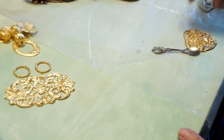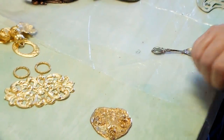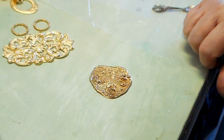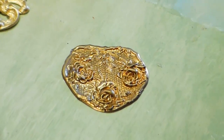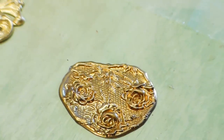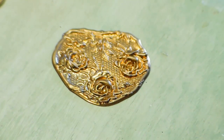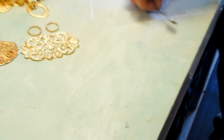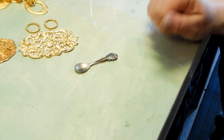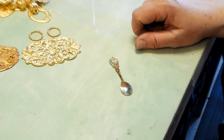This is a piece of raw brass that's been exposed to air for some time — it's got a little reddish patina coming on it. That's because rich low brass is 85% copper and 15% zinc, so you're seeing the copper come out. If you like that, seal it with a shot of Krylon matte spray lacquer on both sides. This other piece I put under my torch — so it's got a funky patina with blues, dark bronzes, coppers, and all kinds of different colors.